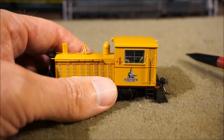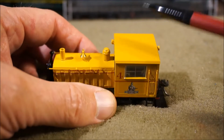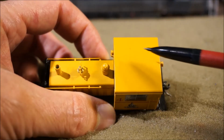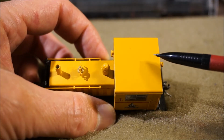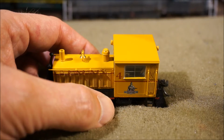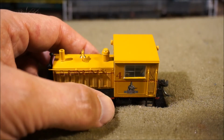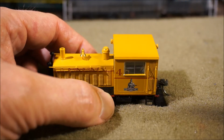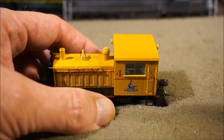Once that was completed, I installed it into the roof of the cab. I had a little cutout because there's a light bar that cuts across here that we had to avoid. I used some poster putty to seal the speaker enclosure up against the cab roof, and surprisingly enough, the sugar cube speaker puts out a ton of sound.